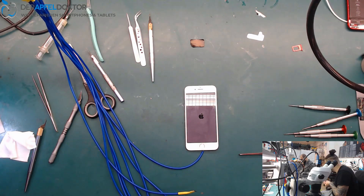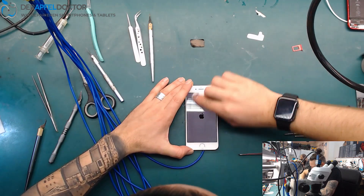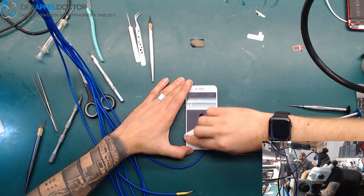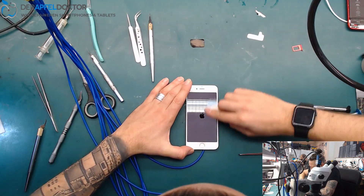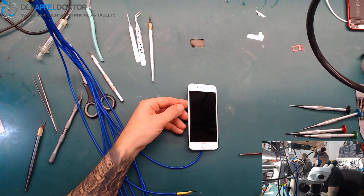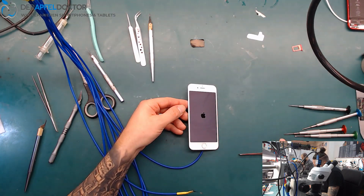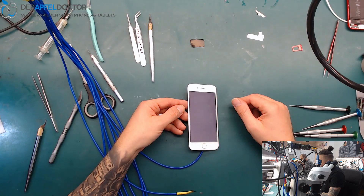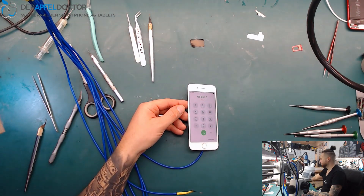iPhone 7 — just a little short on VDD boost and the device just doesn't turn on anymore at all. We just took out the cap because it's placed right next to the big power IC. I didn't want to use too much heat and risk cold solder under the big power IC or under the CPU. So I used a small amount of heat at small temperature to loosen the cap, get it out, and covered the old pads. It's fully working and the customer got all their important data.